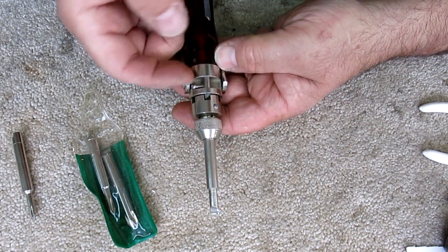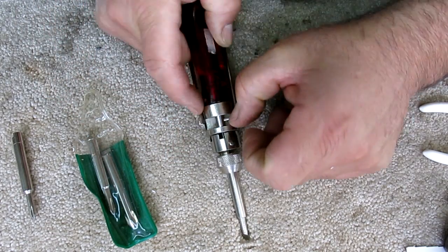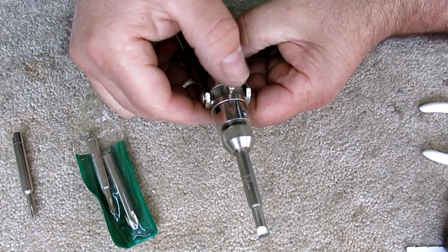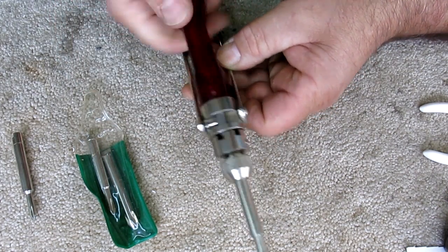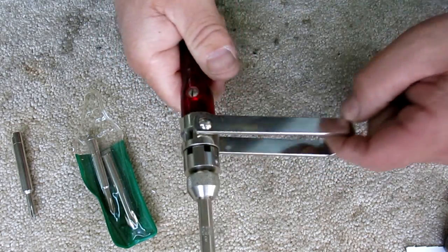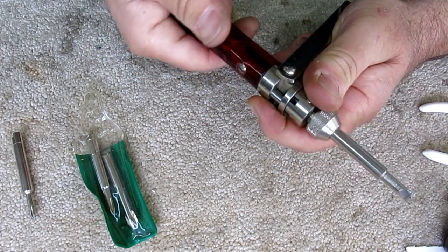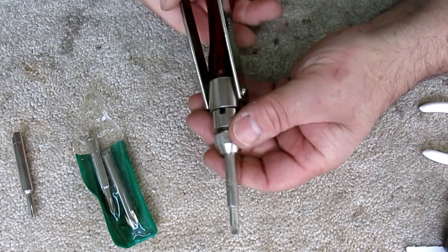It's got a little detent thing here, and you can actually flip this over so you can go the other way. It's just a clever, simple little mechanism for changing directions on a ratchet, or you can lock it up like that. And then this handle allows you to ratchet the thing, but you can push with this and then turn with this one. Oh wow, it's turning the whole mess there. It doesn't really matter because that's driving that part. So it's kind of a high leverage screwdriver.